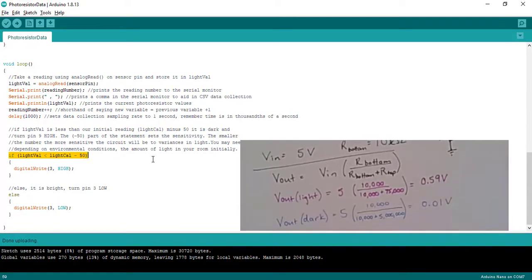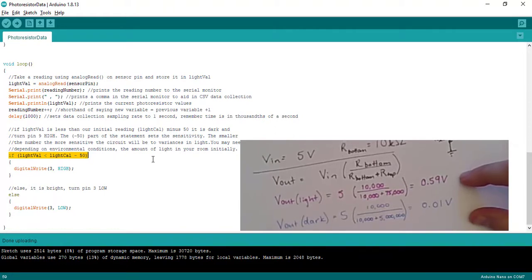Well, when the Arduino reads these values in, it's going to read it as a part of a pin. And so it has a certain number, which we'll look at in our next video, of digits essentially. The max voltage is going to be the high number and the low voltage is going to be the lowest value on that. And so what you're doing is you're saying, I'm expecting some difference in my reading, my output, or my input, excuse me, on A0.